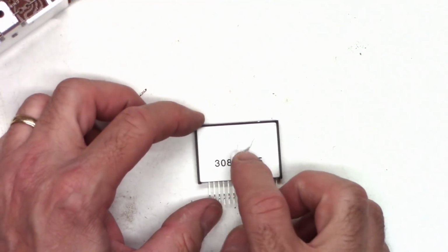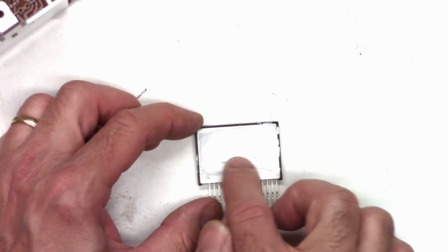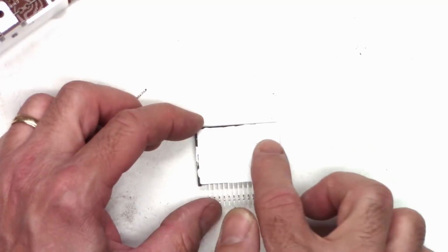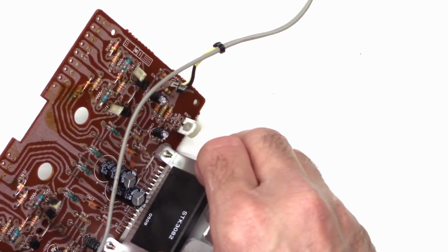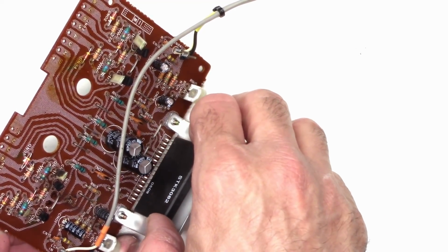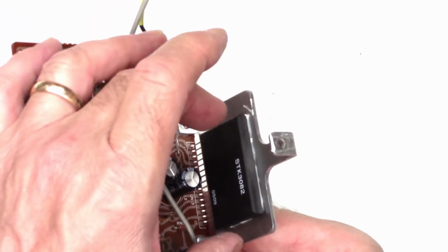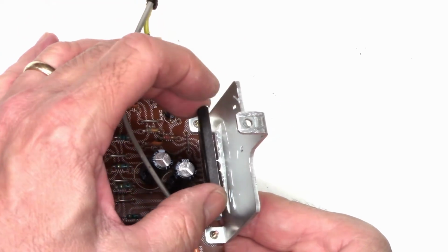We'll go ahead and apply the supplied heatsink compound to the chip. Quality feels okay. It's nice and thin, so it should fill in all the voids on the chip and on the heatsink. So next I'm just going to go ahead and try to line up the pins. Look at that. And I'm just going to let it fall naturally against the heatsink. And then I'm not going to apply any pressure. I'm going to pick it back up and see what kind of transfer pattern.